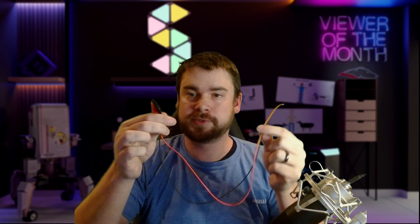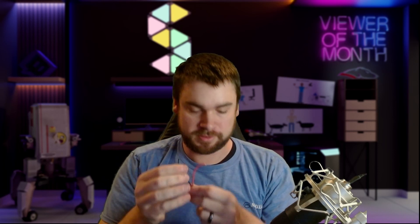The next item is a set of alligator clips — there's a link below. The pack I got on Amazon was about six dollars and comes with two red and two black. I chose these because they have long pigtails so I can extend them as far as needed. Importantly, the alligator clips have rubber protectors on them, so if they're not connected to anything, they won't touch and short out or cause a fire. Make sure you get the ones with protectors — it's not much more money and definitely worth it.